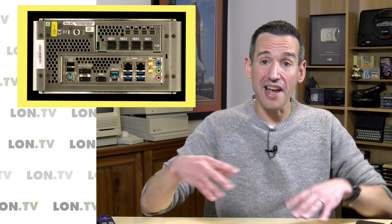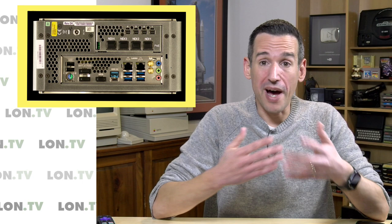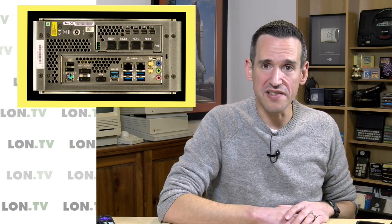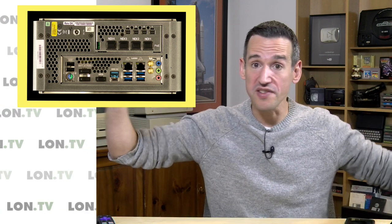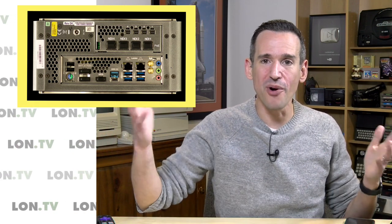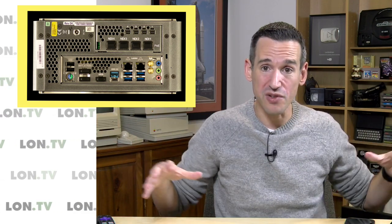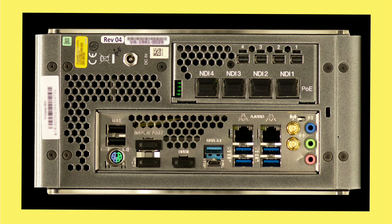I did a full video on NDI and what it's all about — link in the video description below. The bottom line on NDI is that you can take video and put it out over your network with very low latency. I can bring in video from my phone over Wi-Fi, or from other parts of the house either over Wi-Fi or at higher bandwidth through my MoCA adapters. It's a very flexible video format that gives you the entire campus to work with for transmitting video over long distances, and this new TriCaster is built completely around that concept.